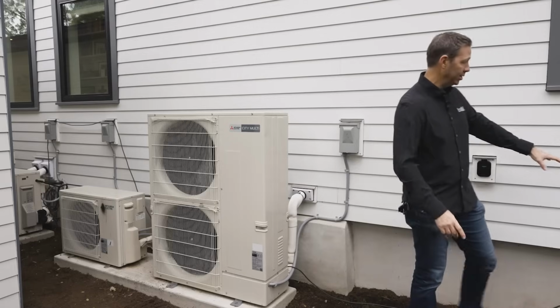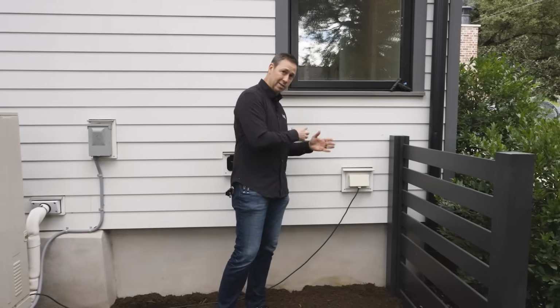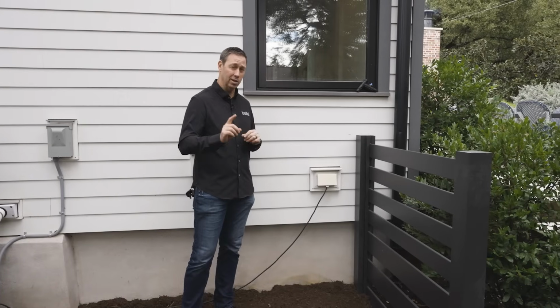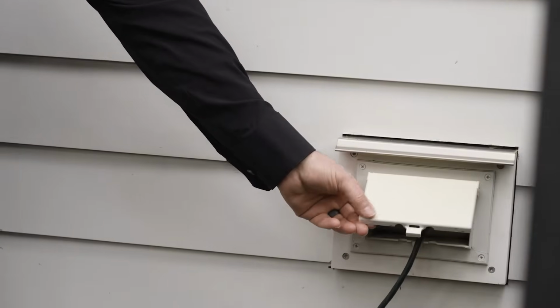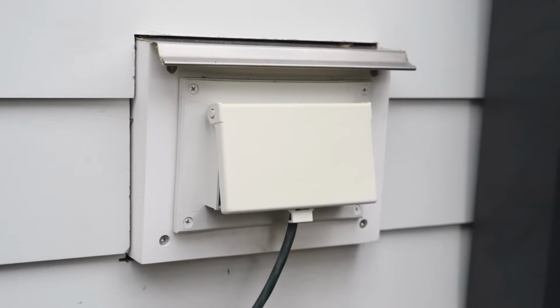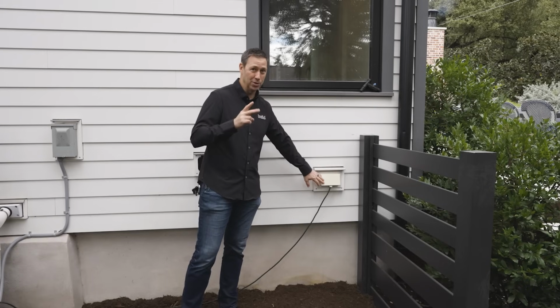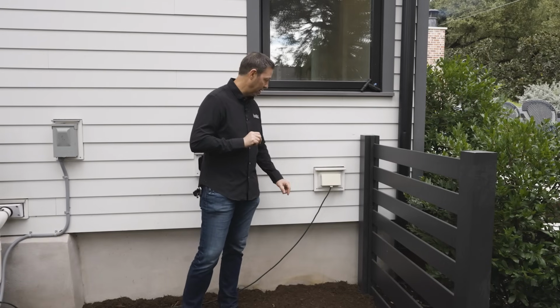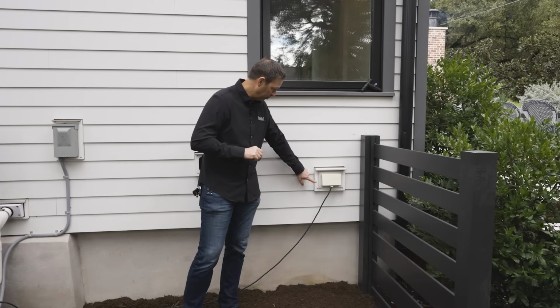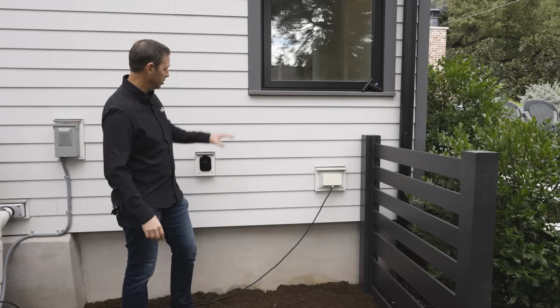So first off, I used some Arlington in-boxes on the house. These are a box that's recessed into that kind of deep cavity that I've got because of insulation. But here's one surprise. Notice the door is yellowing, but the body of the box is not. I don't know what the deal is. There must be a different type of plastic. I didn't paint these knowing that I had white Hardie siding. So it looks like I'm gonna have to paint this cover because it's 2 years later looking pretty yellow, and this is kind of a shady side of the house. However, my stainless flashings, the Versatex PVC that I used, still looking money. I probably need to wash down my siding just because of all the landscaping that I've done, but this is still the original Hardie looking great. I'll talk about that later.